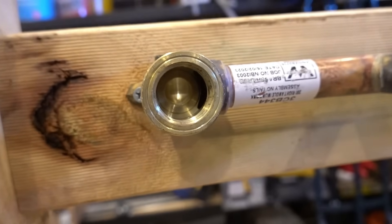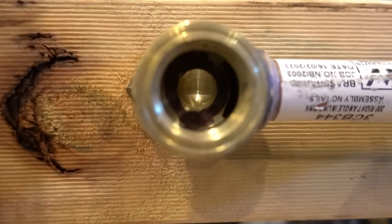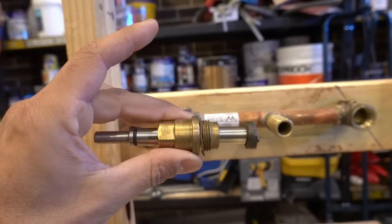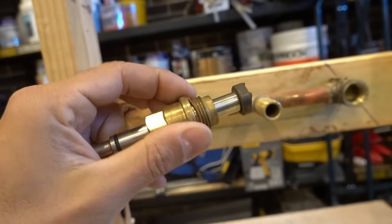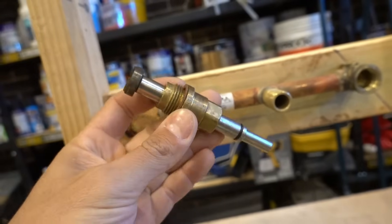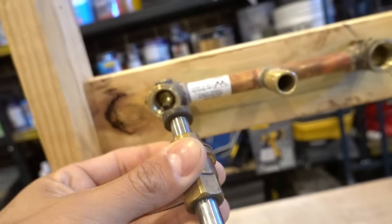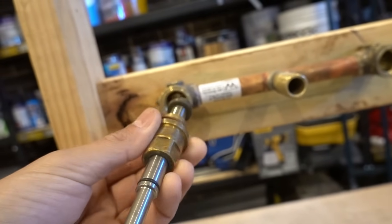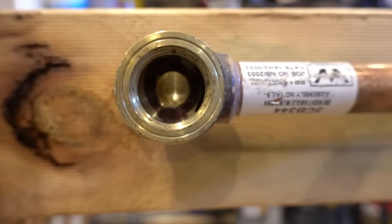What we're going to do next is look at resurfacing this tap seat. I've taken a marker and colored in the tap seat so now it's nice and dark — that's exactly what it's going to look like when you open it up. What we need to do is restore that and make it a nice shiny clean surface again. The way we do this is by using our tap resurfacing tool — links are in the description below. There are a few different varieties, but this one is my favorite because it simply attaches to your drill. It has two little cutting edges that go in there and as the drill turns, it resurfaces that face.